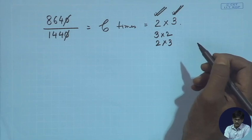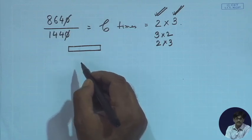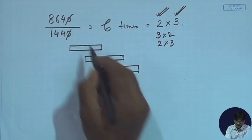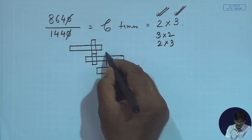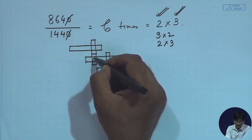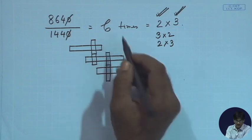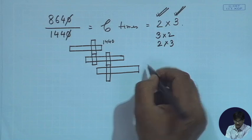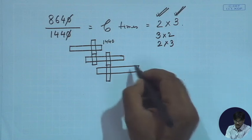Generally, if you have 3 shafts, and here also we are having 3 shafts, and you are bringing down the RPM, the rule is generally to do the first reduction as the smaller ratio, and then do the next reduction. That means, if you are working at 1440 RPM, and from there you have to reach, let us divide this by 10, 144 RPM, so it is 2 into 5. So, it is better to have the 5 reduction last.